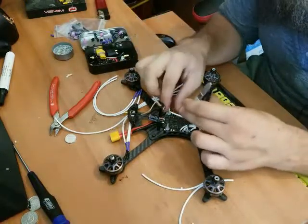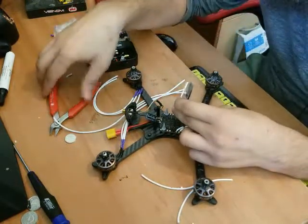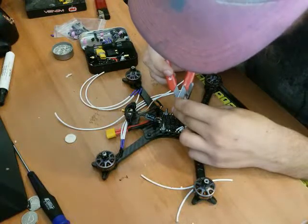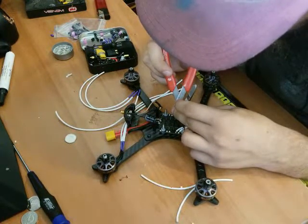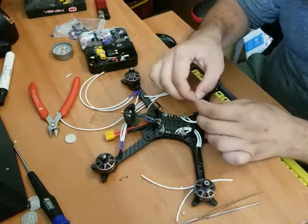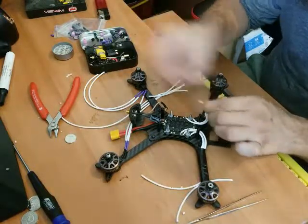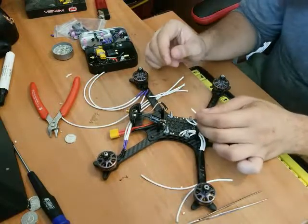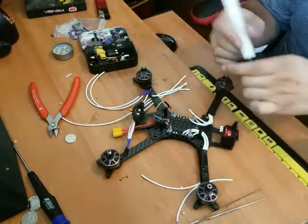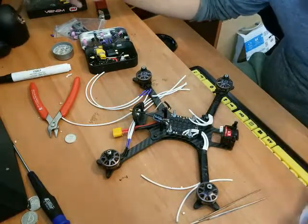All right. Grab that. You can see my hands right in the way, but what I'm doing is I'm sticking the wires together so they look nice and neat, holding right where it's going to go on. I'm trimming the wire just a slight tad past that, like a millimeter past that. Put that, and got to be a little janky. Got to get the thumbnail in, and look at that, nice stripped wire. Actually, that's not quite down far enough, so there we go. That's beautiful. That's exactly what we want right there. And of course, I had a little flux. I'm just sticking between the standoff and the stack screw just to hold it in place for me.